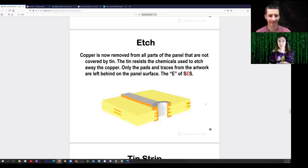Electroless plating will be a very high quality plating layer because the rate is so slow — you can be sure there are absolutely no gaps in the crystal structure. When you electroplate copper and plate faster and faster, you have to be much more careful because any spot that starts growing a little faster — maybe the metal is a little thicker there, the current density a little higher, the electric field a little stronger — that spot will start to grow faster, you'll end up with a little spiky point, and you'll get a roughness all over the board at the micro level.